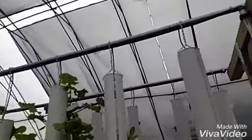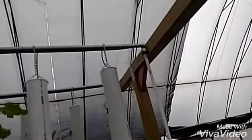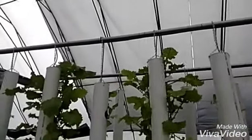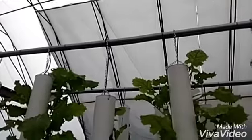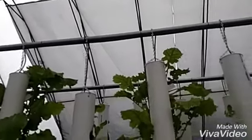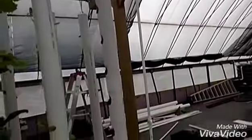I think that'll help the solids move all the way through that pipe and not get stuck, because those little barb fittings on that quarter-inch line — those poke up in the hole and there are just pretty small holes through there. It doesn't take too much to get them plugged. So I'm going to try that and see how that works.